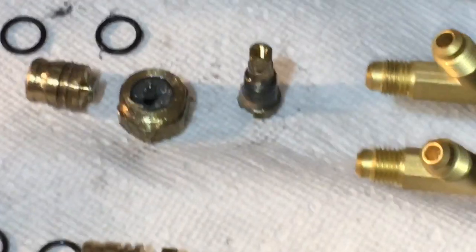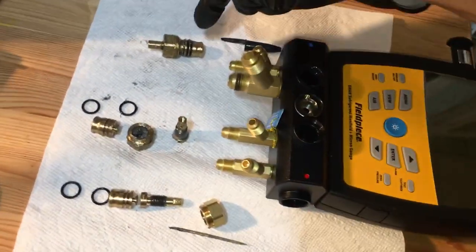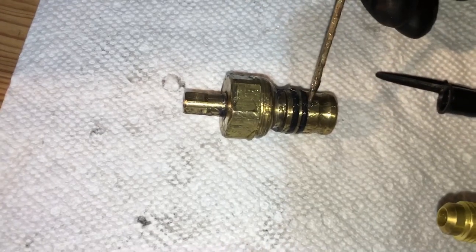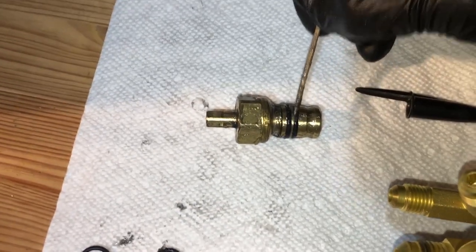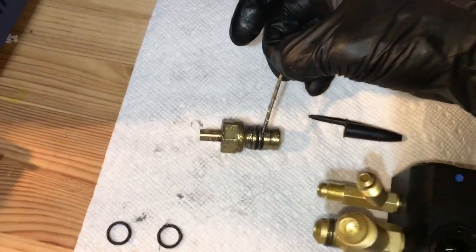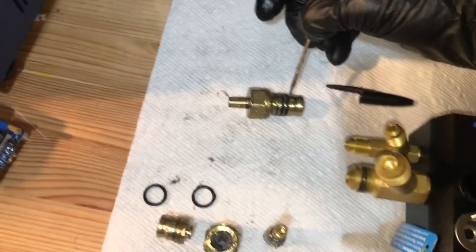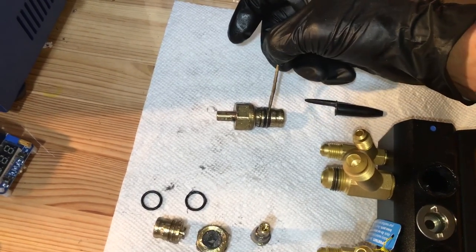Since I don't have to show you everything, let me take this back. I'm going to show you just one since I already have the O-rings installed with silicone grease. That's grease — not silicone caulk, the kind you put in your bathtub to seal tile — this is silicone grease, dielectric grease. Under high vacuum situations in laboratories they use silicone grease to seal two flat surfaces together, to seal extremely deep vacuum. But under really deep vacuum they don't even use silicone, because even silicone outgasses and leaks.